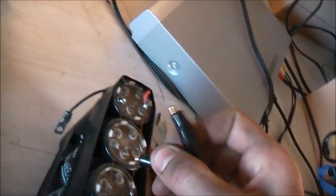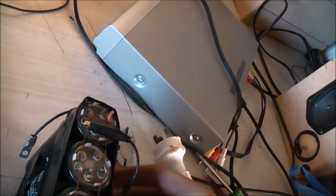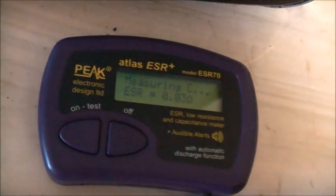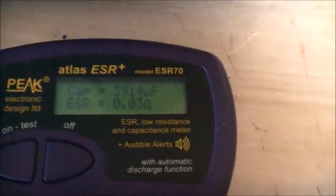Just double check they're okay. Yeah, the capacitors have a lot to do with it — that's why I'm getting a stupid amount of amps being pulled. 0.03 ohms ESR. It should be about... yep, 4,000 microfarads thereabouts. Yeah, that ESR's just fine. There are way too many microfarads for this circuit — that's why it was pulling stupid amounts of current and wasn't restricting it enough.